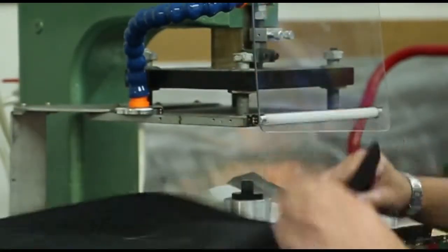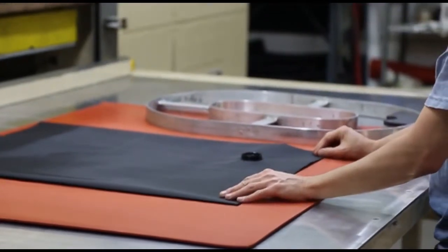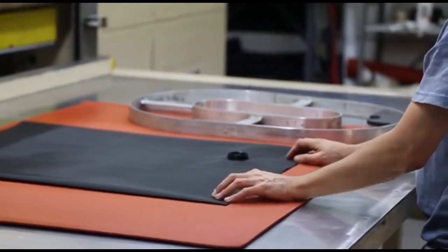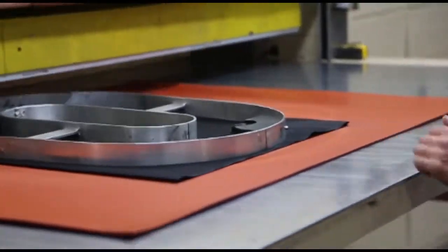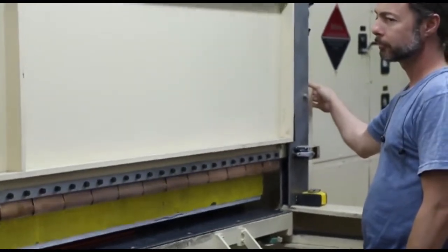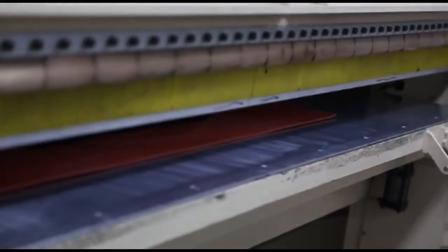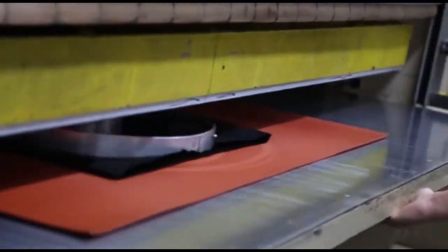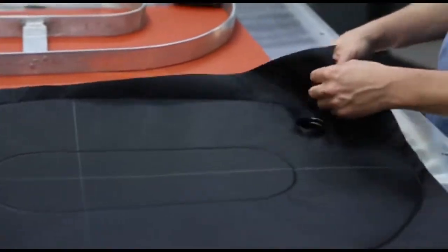This is to make sure that a cold weld was avoided. Then the two fabric sheets are lined up on a large RF welder and a pre-made custom aluminum die is set in place. It is moved into the machine, the unit comes down onto the die, which presses into the material and sends radio frequency waves through the die into the material, creating a strong weld without damaging the material. 27.7 megacycles are used to jog the molecules back and forth until they are fused together.